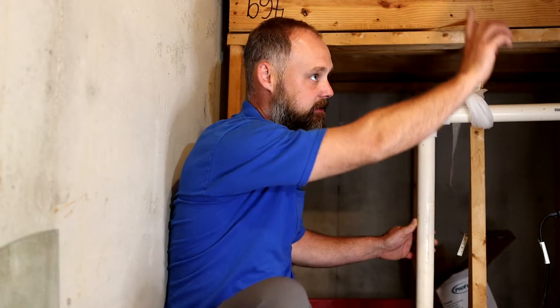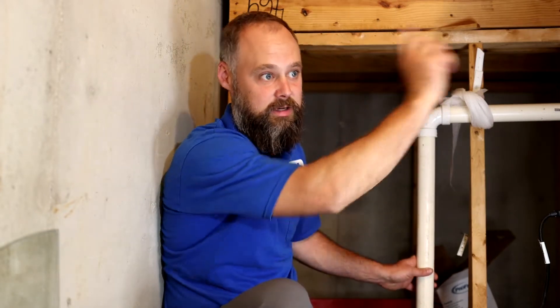The pit is about two feet deep, and there's a pump inside it that just pumps it out through this line and pumps it all the way outside. It doesn't go into the sewer system — it should go outside, away from the house — and it prevents your house from flooding, so it's really important.